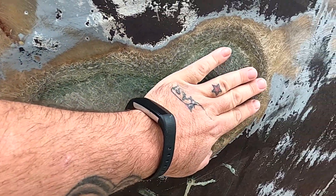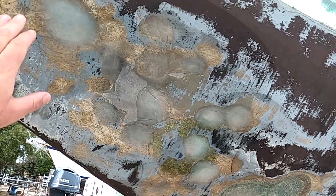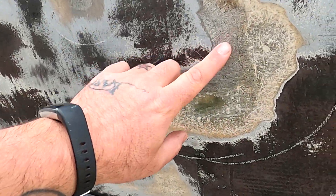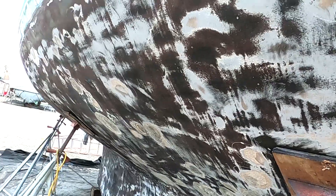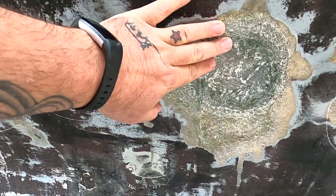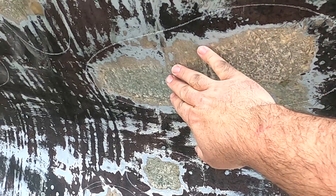This thing's just massive. I'm a big guy — that's two handfuls. You can see they started filling in a lot of the small ones already. It was more just the very top layer of barrier coat — they sanded them out a little bit and they're filling them with thickened epoxy. And again, another one — see the old repair, new blister. So almost all these are old repairs that just didn't hold up. This side of the boat is a lot worse than what we first thought — really, really bad, and I don't know why this side was so bad. Old repair, blister, old repair, blister — some are huge, some are still a little sappy.